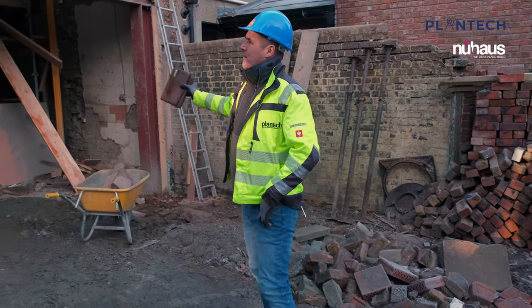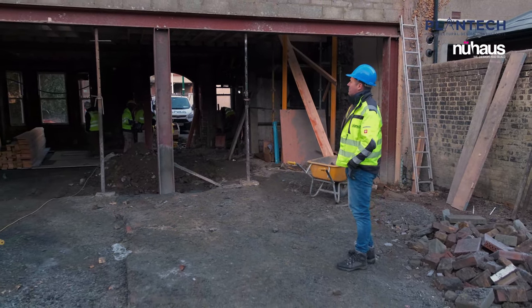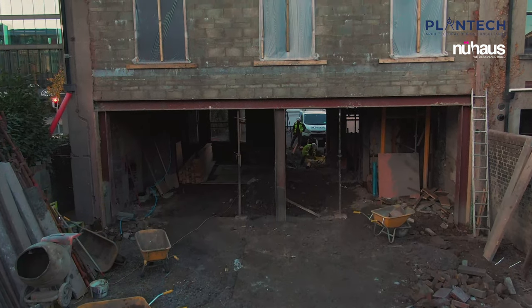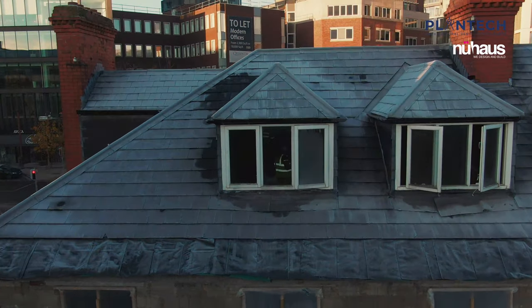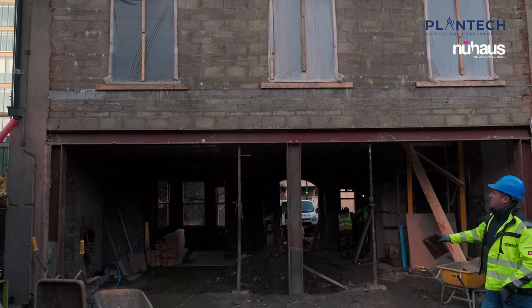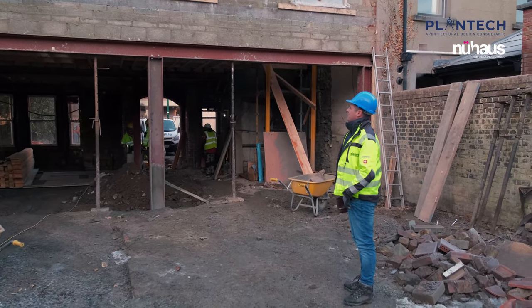You can see the back wall elevation on the first floor which is rebuilt and restructured — you can see the ring beam just below the window sills. A full reinforced ring beam was poured at first floor level and also just below the attic joists. Full ring beam on the gable wall, and all of the timbers at attic and first floor replaced. The new timber wall plates replaced and rafters at roof and attic level replaced.